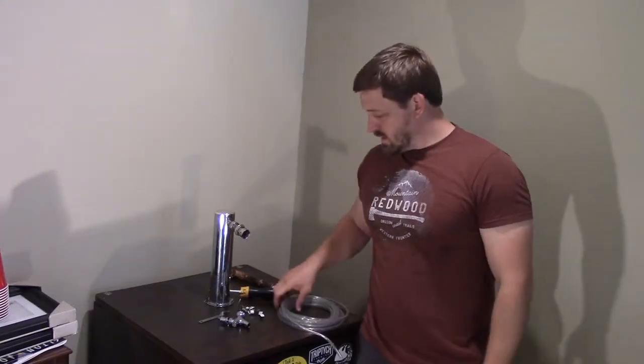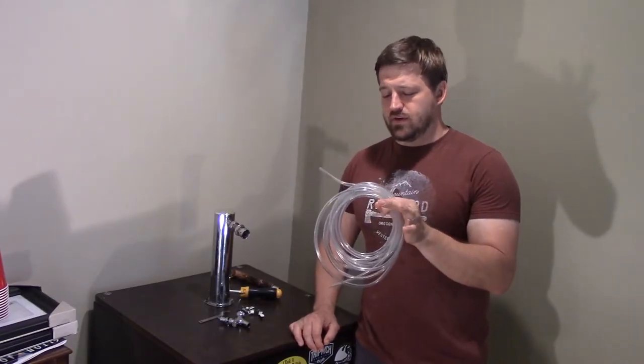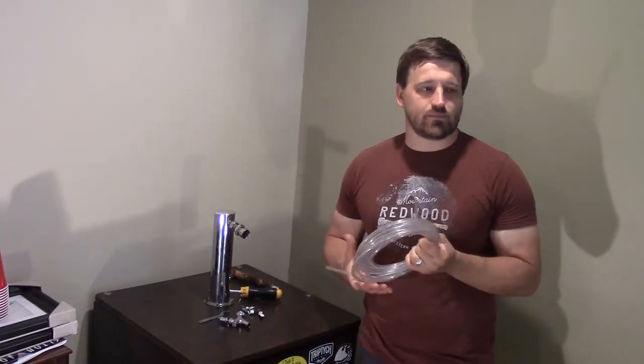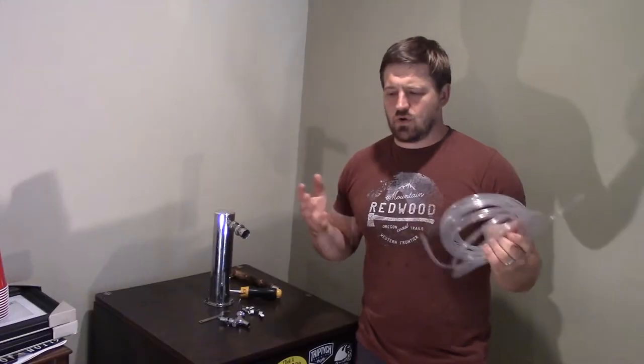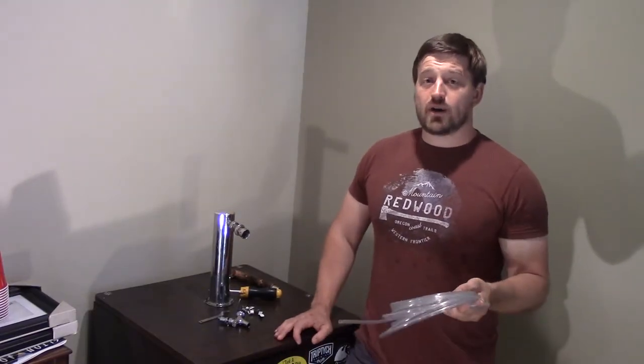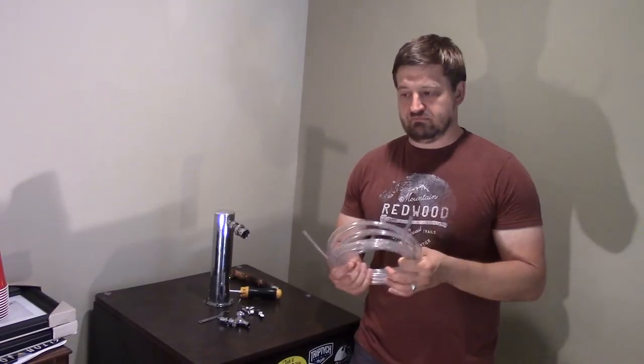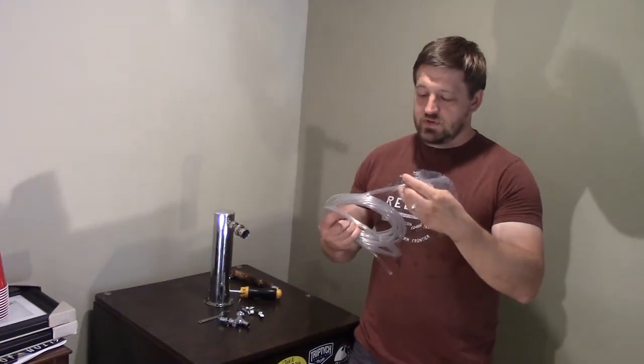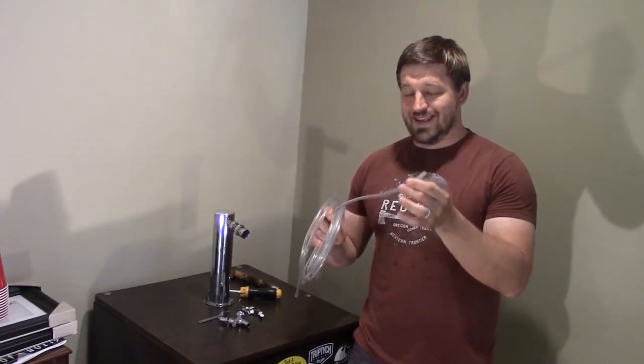It's a pretty short list of stuff you need. As far as things I purchased, you're going to need the right kind of hose — PVC food-grade beverage hose. I took a lot of research on this item. There are some industry standards called NSF 51, NSF 61, and ANSI 3 — lots of numbers and acronyms. After reading up, there's a lot of debate about which is most appropriate. I even came across a blog about somebody who uses polytubing, which is lined on the inside with some type of polymer that reduces the tainting of the beer's taste through the hose. Long story short, do your research and make sure you get the right size and kind. What I'm using is a 3/16th inner diameter PVC tube, and it is NSF 61.